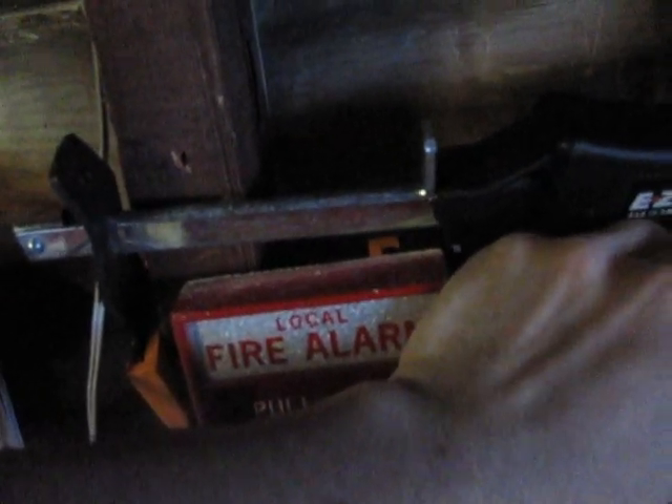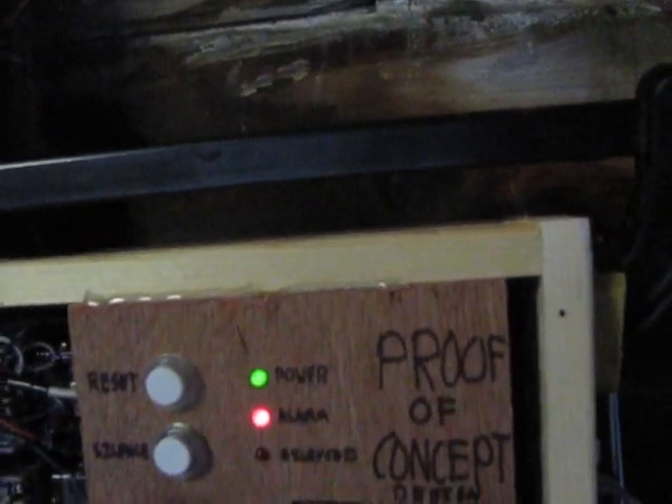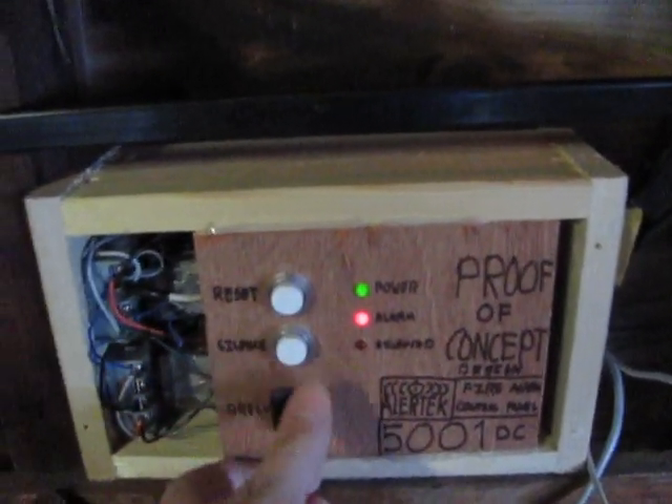There. Very simple panel. Reset. Now it's only one back, as you can see, but I could add another one if I wanted to. Let's do that one more time. There. The drill switch doesn't work right now because it's already activated. Reset. Now, if the zone isn't reset, the panel doesn't reset. I'm going to put that flasher back in now.